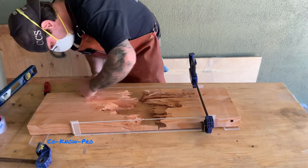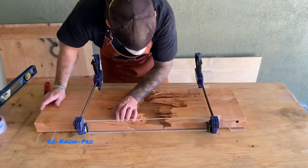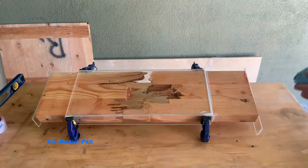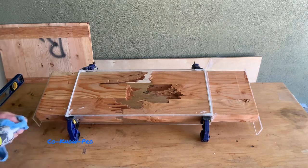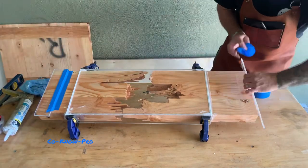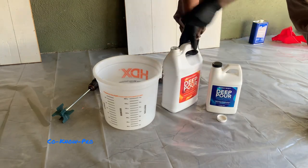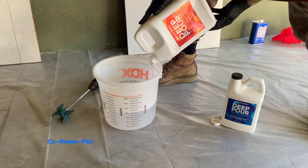I gave the form a little bit of play so the epoxy could flow into the side pieces of lumber and get in between all the cracks to create a strong connection. I made the form about a quarter inch larger on each side — that's why you saw those little spacers — so when I clamp everything down it still has space for the epoxy to set in. We're sealing everything around the edges with acrylic caulking so the epoxy doesn't leak out. But like I say, go to Upstart Epoxy's website and you can buy prefab forms.